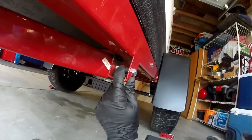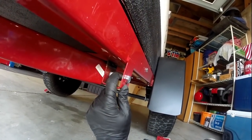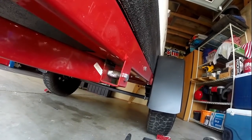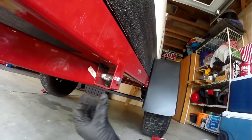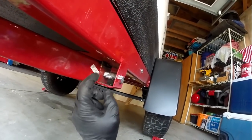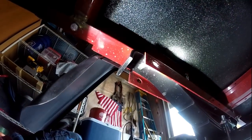So I got the second bushing in, and I'm also going to do bushings in the spring hanger of the slide spring, which is the rear part of the leaf spring, because it's just an open hanger without even this, and they're squeezing together. It's so cheesy. So I'm going to make a couple of these for the rear too, so I'm going to do that next.